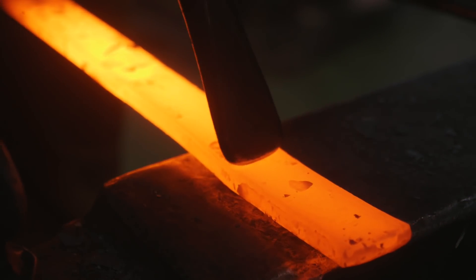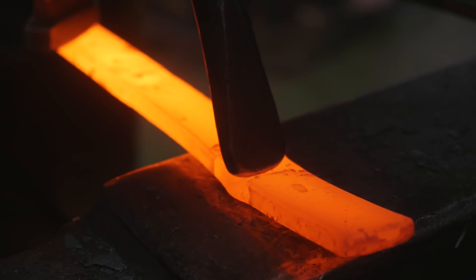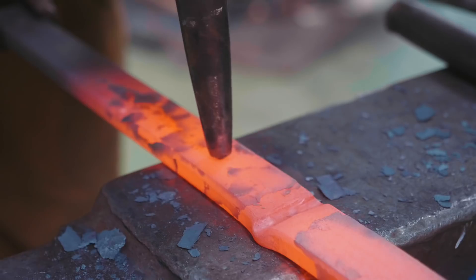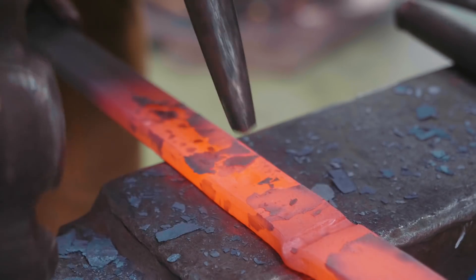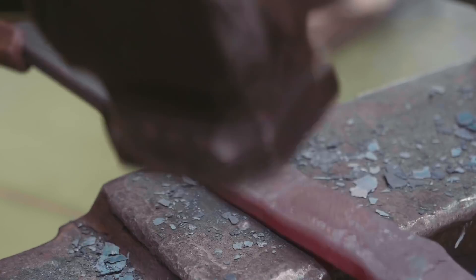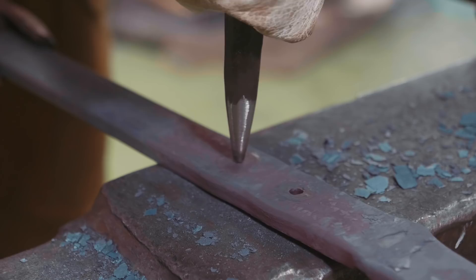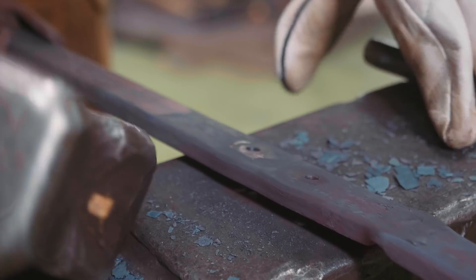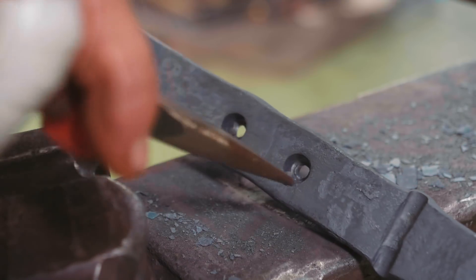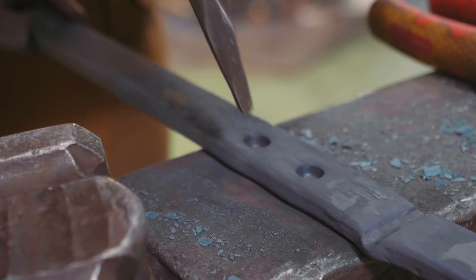We're actually not working on punching the holes yet. First thing we're going to do is the same thing again on the other one, since we have the two pieces in the fire. Still got some heat left — start punching the holes. We'll now pop the plug out of there with a small punch, just like yesterday. Didn't quite line it up perfectly, so they're just hanging on by a tiny little thread. There we go, there are the plugs. We forgot the touch mark — never forget the touch mark.